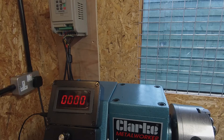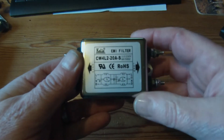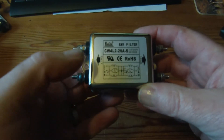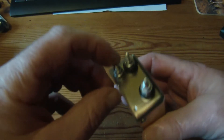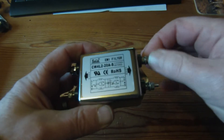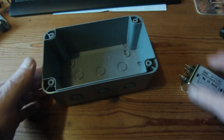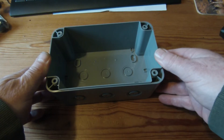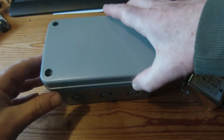In memory of Meatloaf, who so sadly passed away - the EMI filter has turned up just now in the post. So we can get that fitted. I've got the line side there, load side there, and there's a single earthing point. Obviously you've got exposed terminals on here, so I've got this box to fit it in - a little bit overkill, it's an outdoor power box, IP55 rated, with a sealed lid and everything.